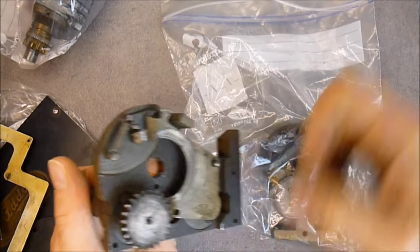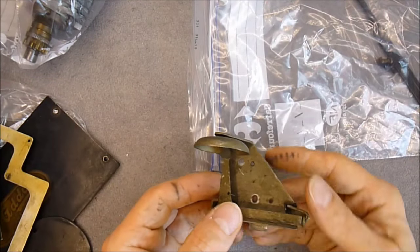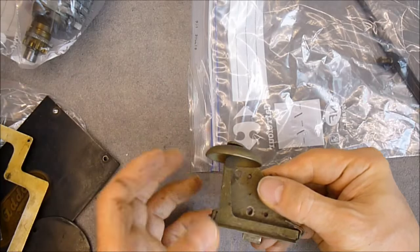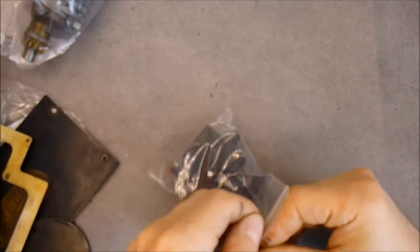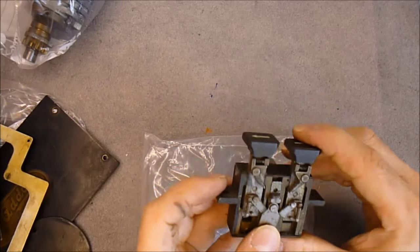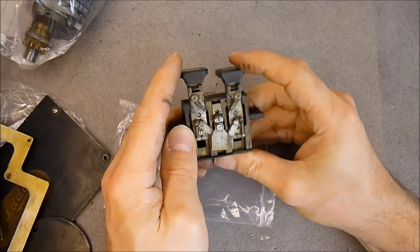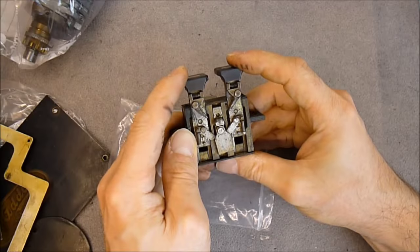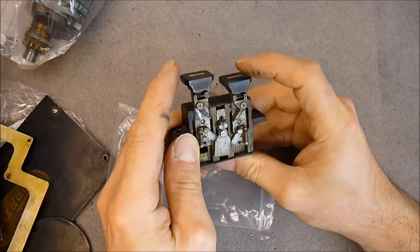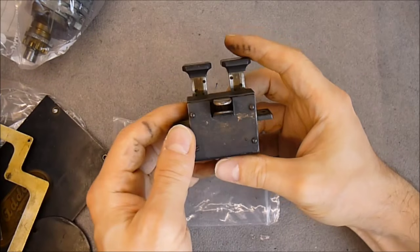So these are really, really strong. And apart from that, there is here a little bell which rings when you do a negative calculation. And last part is this carriage shifting mechanism. Which is not simple, as you can see. So you can only push one key at a time, you cannot push both. In fact, the one which is first will take priority, more or less. So this needs really some grease, it is really hard. And good cleaning also.